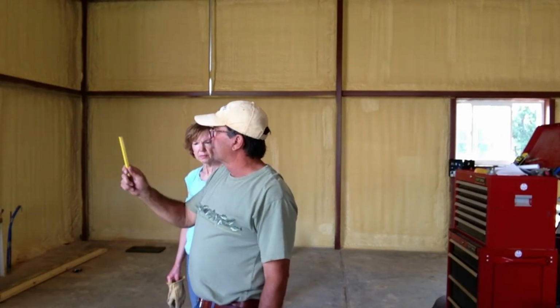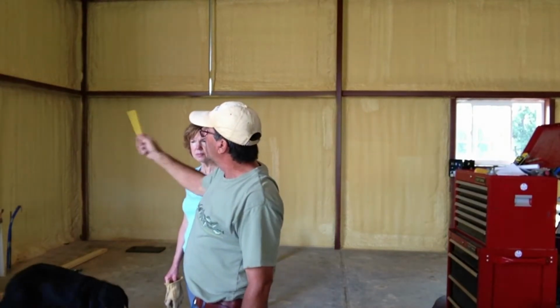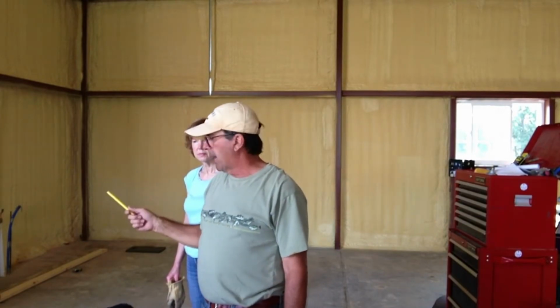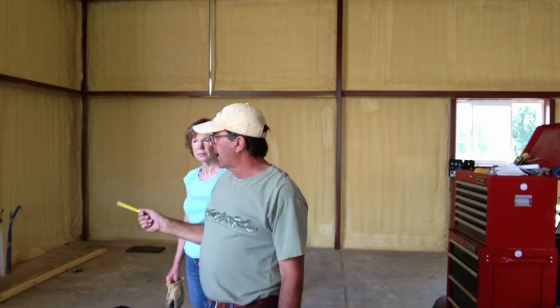So if you use drywall or plywood, in our case, we're going to put sheeting plywood 8 foot across all along the building here to hang stuff on, except for in the bathroom, where we'll put drywall. But you've got to think about it. If you're using 8 foot material, then you have to allow for that 8 foot material. You need to subtract off that plate.